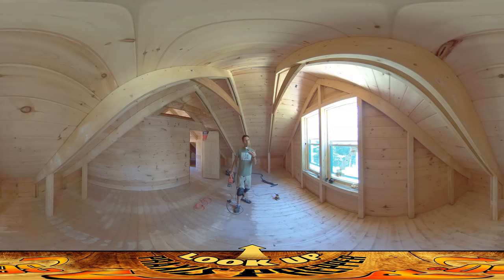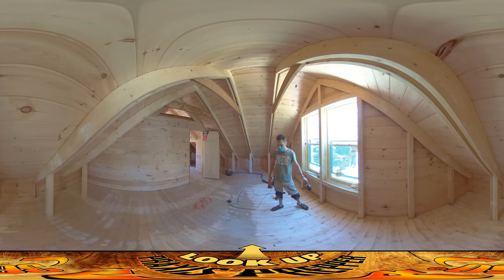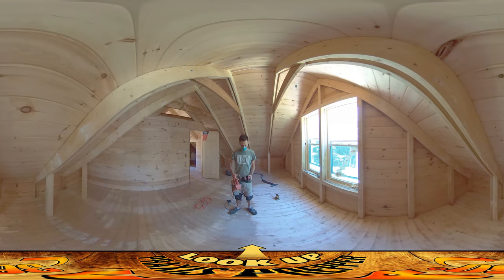Let me show you the procedure for doing this. Not surprisingly, wear PPE. I'm not going to make the usual gags about people not wearing it — it's a good idea if you're in a dusty environment. Protect your lungs, you only have two of them. I'm also wearing hearing protection because this thing makes some high-pitched noises. When I'm doing this I'm going to do a swirling pattern because this thing can really grind into the floor. I'm just taking it down to a point where it has a natural look — I don't want to completely strip off the top. So I'll do a light swirling pattern, changing over different areas so I don't get any hard edges.